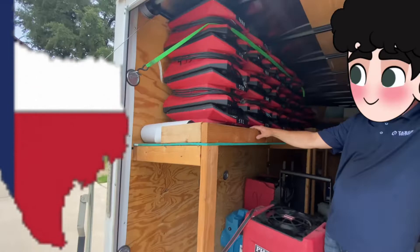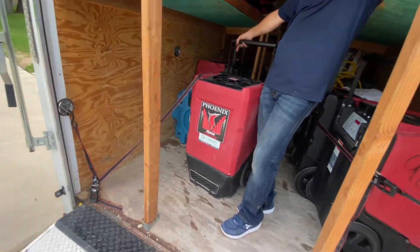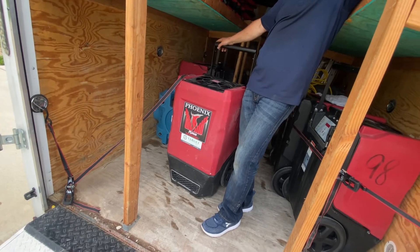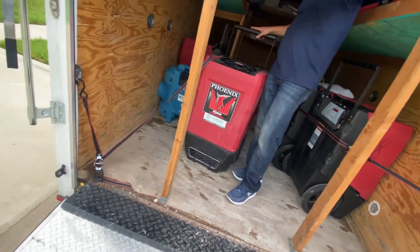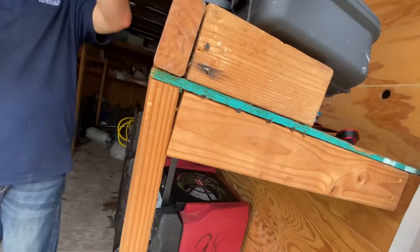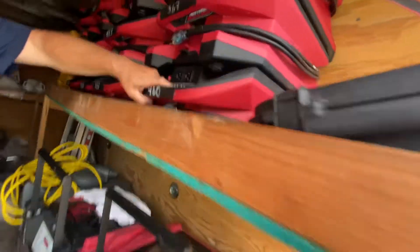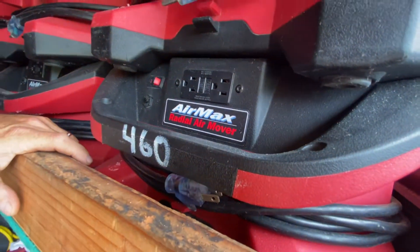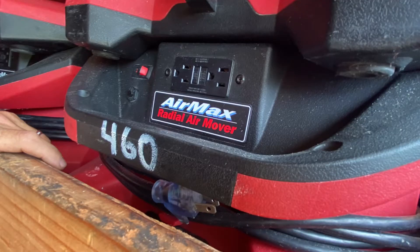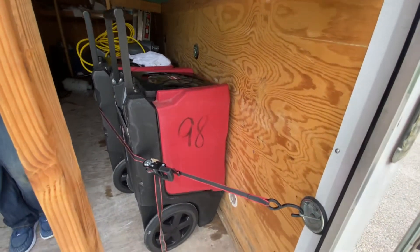If you had a category 3 loss or whatever like that, I would place that piece of equipment down there — that blue thing down there. But we have no need for it. And that is what we call an air scrubber. We've got everything we need. These are called air movers — you can read it right here, it says radial air mover. These only move air, that's all they do. They're just a fan — air movers. They push a very large volume of air.